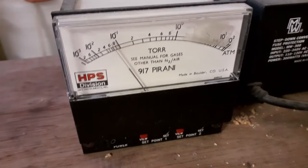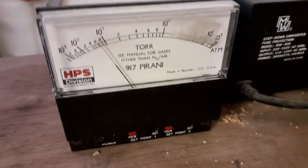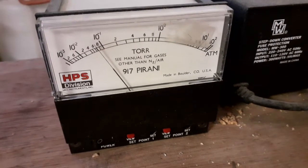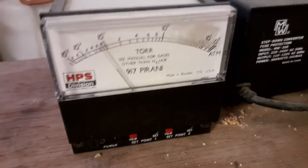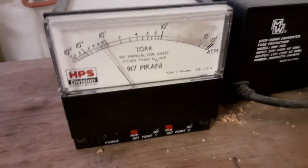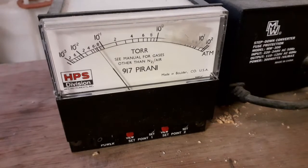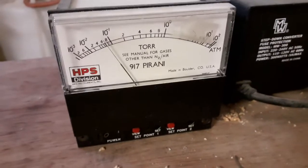After about 15 to 20 minutes, I think this isn't going to pump down with the mechanical pump any lower than this. I suspect it's pumping away water vapor from inside the chamber, and possibly from the silicone fluid as well, and it'll be stuck here for a long time. You could probably heat up the chamber to drive off that water vapor. I haven't had this chamber pump down for a couple of months, so there's probably rust and various debris from inside the workshop - it's very humid here. Could also be a small leak. But I'm within the range of turning on the diffusion pump, so it should be okay. I'll leave it a few more minutes and see what happens.